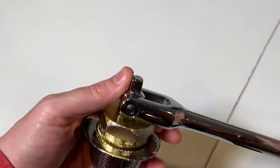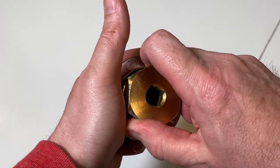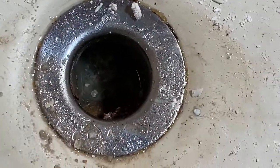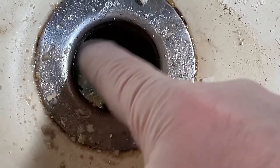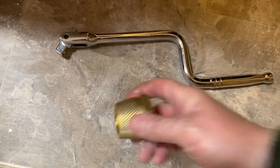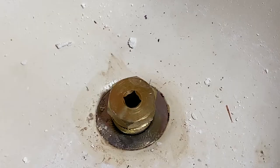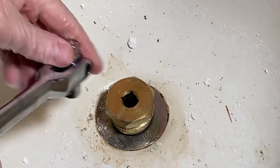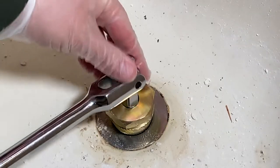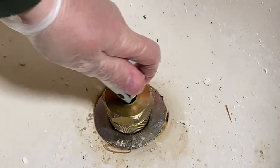I'll put a link for the tools I use in the description box below. Let's check out a little video of this in action. The problem we've run into here is the drain piece is gone — you can't actually pull it out. So we've got a breaker bar and this extractor right here. We're going to stick this down in there and pop it out. This just goes right down in here and right on there like so, and then boom — it just twists right on out.